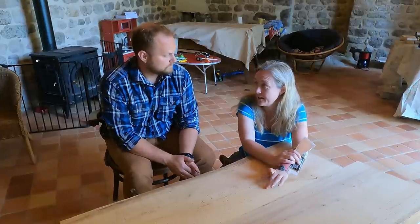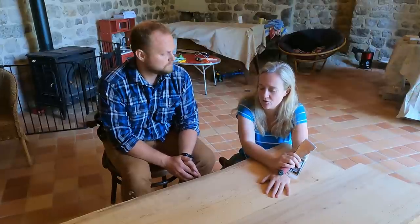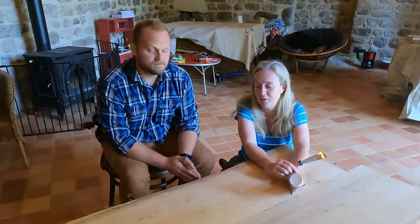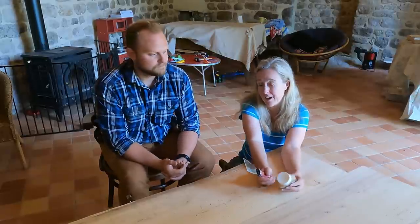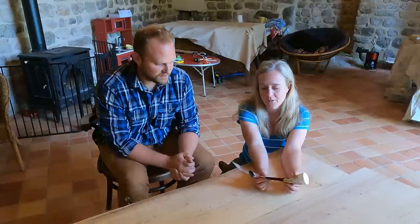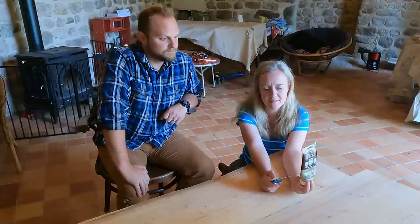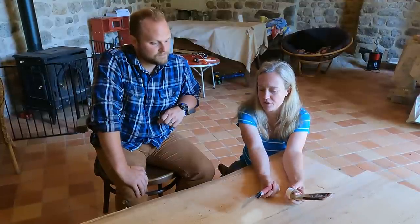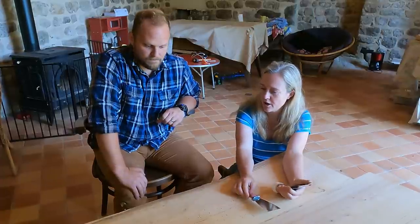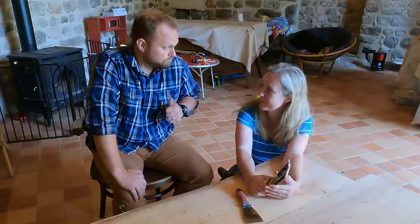Yesterday — I didn't film it — Jason treated the wood and it's all nice and dry now. What we'd like to do is fill in a few of the holes so it's not quite so obvious. You want a bit of character but there's too many, aren't there? Yeah, it's a bit too much. So we have pâte à bois, a wood filler paste. Are you happy if I just leave you filling in these little holes? Once you've filled it in we'll let it dry, then just sand it off and see what it looks like. Sounds good.